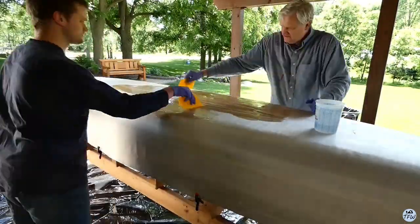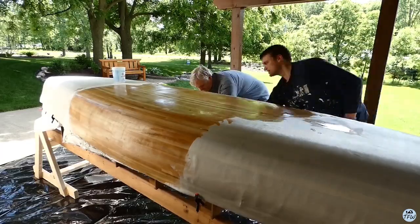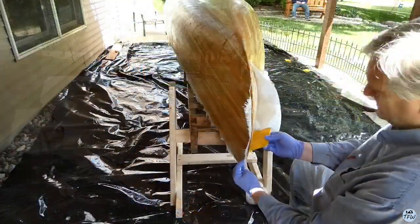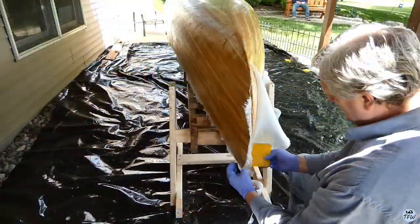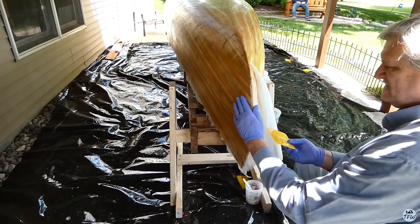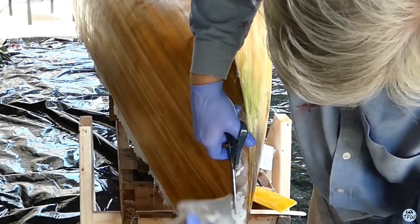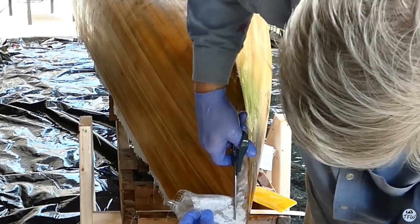And this is our fourth watercraft build, and we've sort of learned to work from the middle out so that the fabric stretches the right way and doesn't bunch up. Also on the stem and the stern, we overlapped the fabric so that there are two layers just with this first layer of fiberglass, two layers covering the stem and the stern.